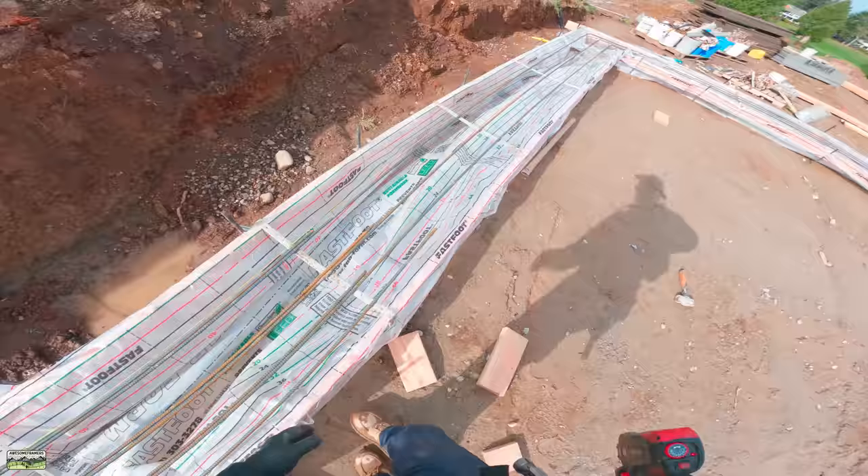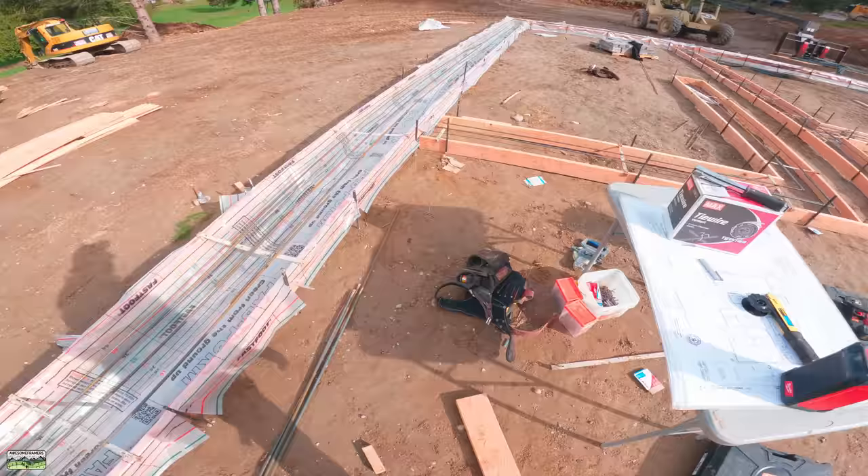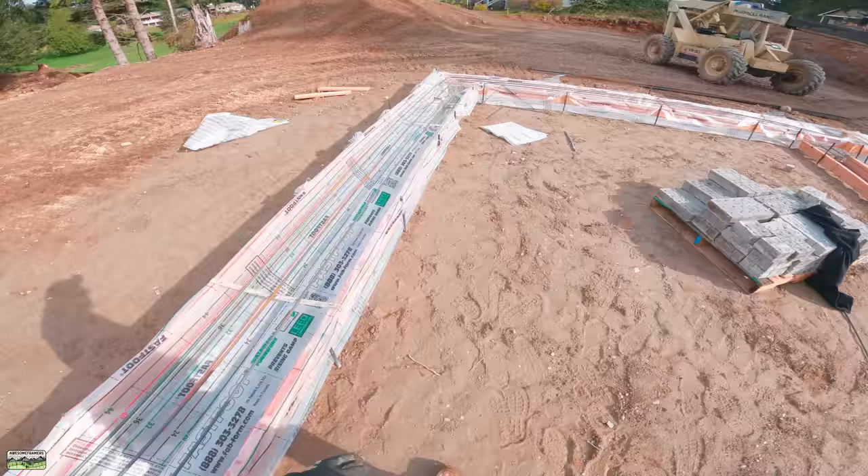You can see very long overlaps there. We only need two-foot or 30-inch overlaps typically - that's what the engineer will call out. We just let the bar run long. What's the point of cutting it? We already have enough scrap. There's kind of a glimpse into our thinking.